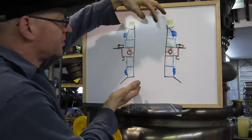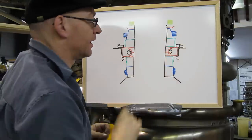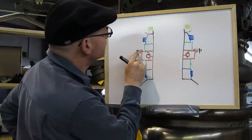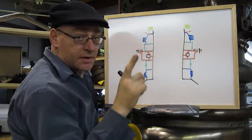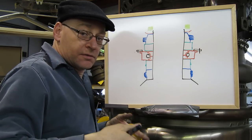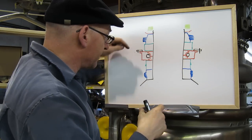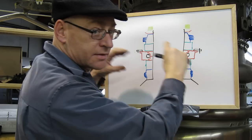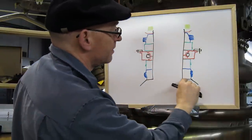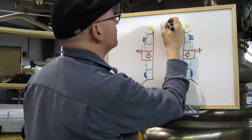We've got all those pieces stuck on and torqued. I've changed the drawing slightly to include this little profile at the rear face of the thrust bearing outer race. That slips into a cavity in the mid frame of the engine, and there's a little plate that goes on over top, bolted to secure the bearing outer race in the case. All these elements are stuck onto the shaft by this shoulder and the clamping force of this nut being torqued to 600 foot pounds.